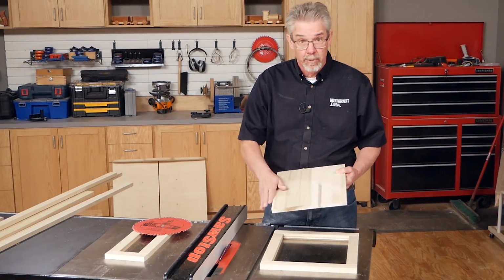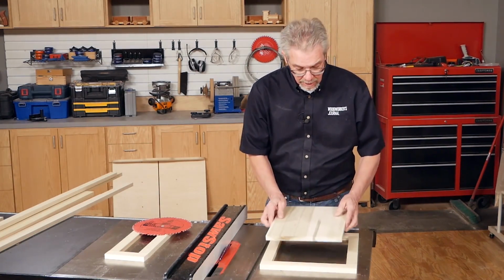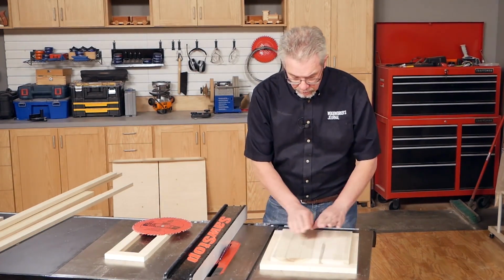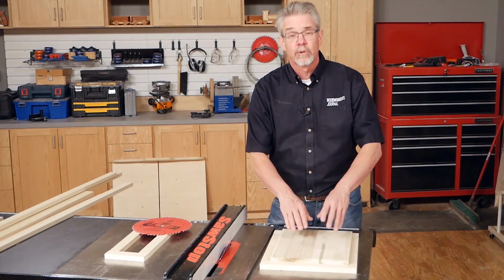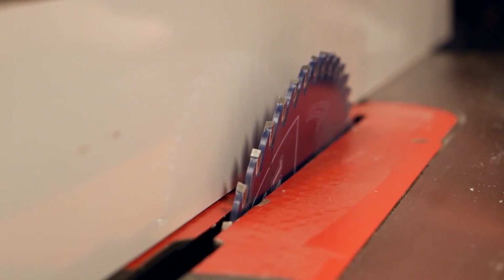First, of course, you glue up your panel, and now that you've got your stiles and rails cut to size, you can cut the panel to its final dimensions, leaving room for wood movement. Setting up the angle is again a process that should be tested on scrap lumber.